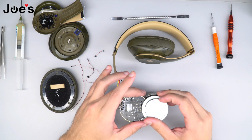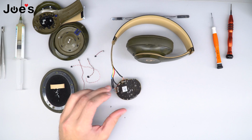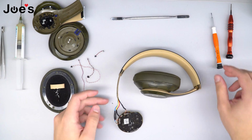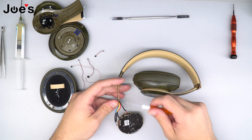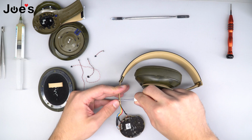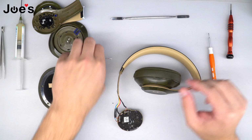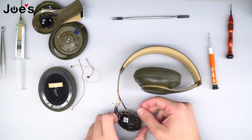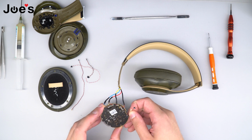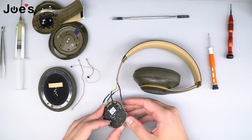Once all that is complete, we're going to release the Bluetooth board from the vise grip. The next step is we're going to pop this little tab up so that the headphones aren't loose when they slide, and we're going to start plugging the wires in. First one, we're going to do the short MS port wire. Make sure that you're plugging it in correctly so that you don't damage any clips on the inside.